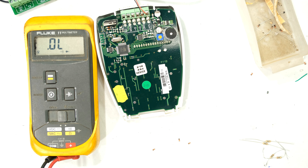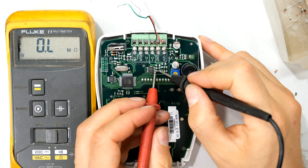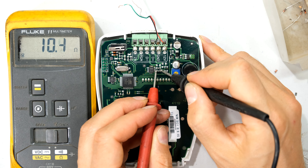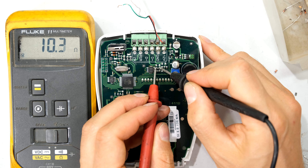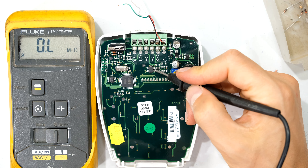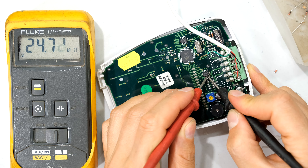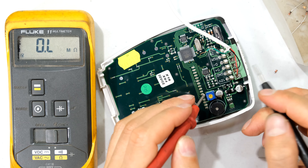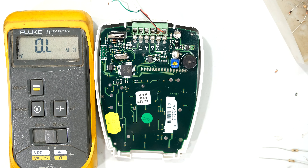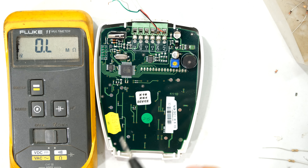Just before I do the repair, I want to measure the other resistors to see how bad the damage was. There's a 10 ohm here and a 10 ohm there — those are functional. I'll also measure between the two input pins on the IC. The reading is in the mega-ohm range, so this IC's input stage has not been popped. I can now continue. You'll only get a fair measurement once the diodes have been removed.